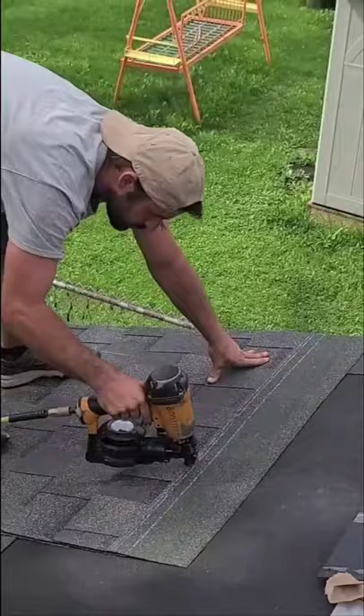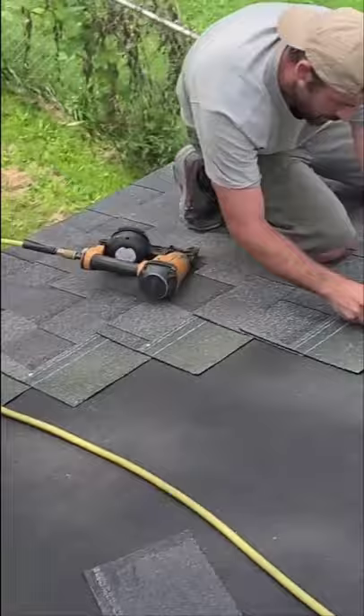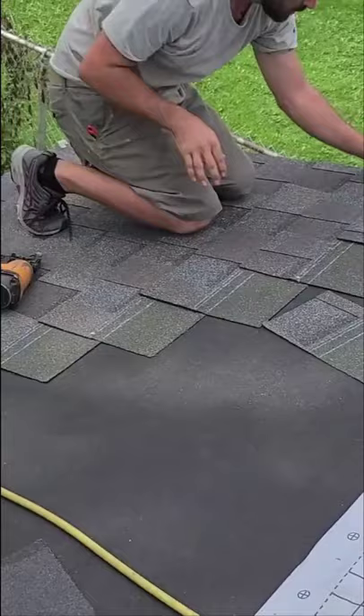The reason I stacked these three before cutting is to keep it straight. A lot of times you look at people's ends and they'll frown or smile when they pre-cut them and nail them on. You're more than welcome to pre-cut them yourself, especially if you're not certain that you won't cut through that shingle below it while it's in place. Now as we nail these, we skip over a little bit on every single shingle so that we don't have a nail fall on the seam. Thank you guys for watching.